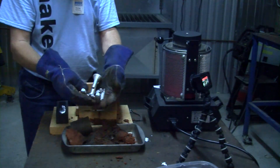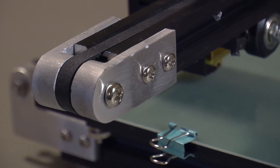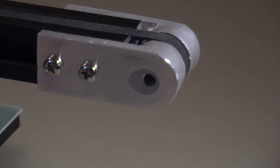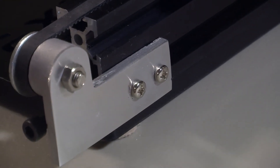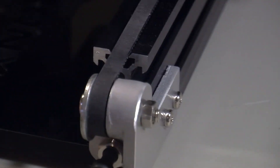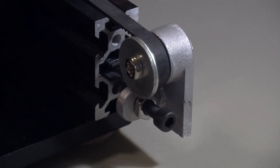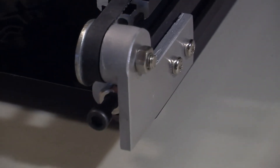Looks pretty good. So this is the result — finished up with a casting saw, drilled and tapped. This is how the front one works: this side is tapped, so the other side just drills through and you don't need a nut. Down here is the other one — again it's tapped, I have a nut on there just to lock it. This little screw right here can be used to tighten up and press against the side or end of the rail. It's a nice thing and a good way to make good sturdy parts — much better than plastic would be. Thanks for watching.